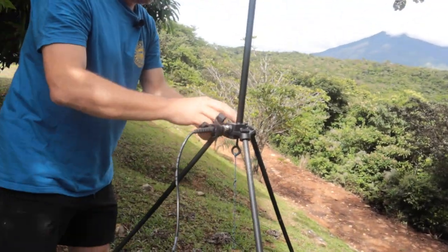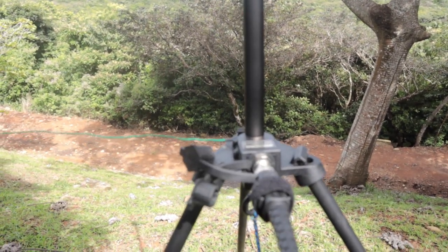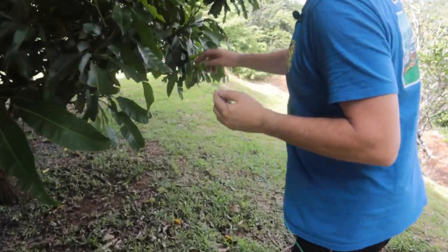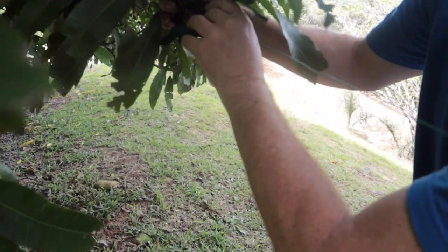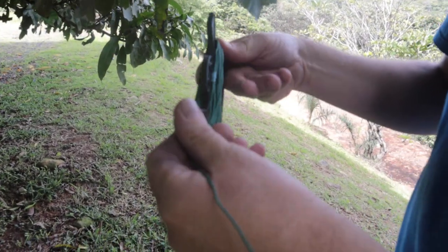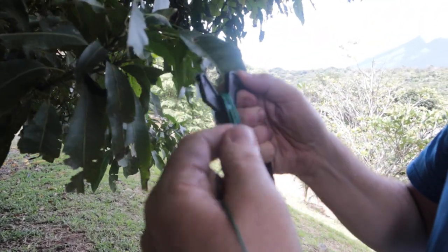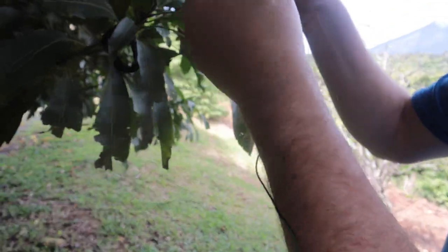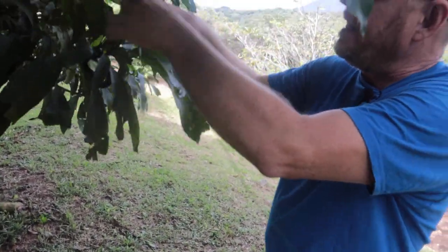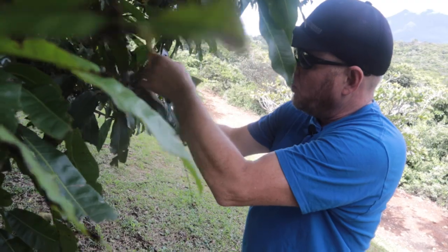I've set the elevated radial out prior and gone out to the mark on the wire for the 20 meter band. It might be a little dark here in the shade, but I've come down to some marks we've placed on the wire — there's a blue mark here. When there's no wind and I'm out with some bushes or something, a lot of times I'll just lay this on top of the bushes. I did that earlier on this tree, I pulled this through, and it did fine just holding in place above ground.